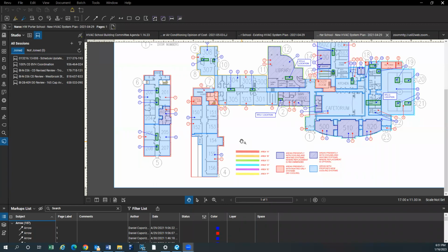Could you do it with a Mitsubishi split in lieu of a VRF? Absolutely. I think it's going to cost about the same amount of money. I don't know that you're saving any money. The one thing the VRF gives you that you're not going to get with the Mitsubishis is that typically a Mitsubishi is one condensing unit and one evaporator unit. Whereas the way this is set up right now, you have refrigerant boxes that collect the refrigerant, so there are fewer units up on the roof that you're maintaining. You've got less refrigerant, running piping from fewer units rather than on a one-for-one basis.